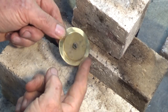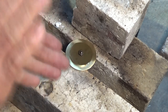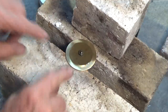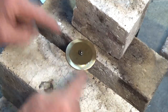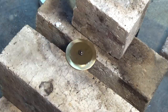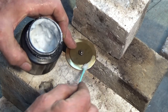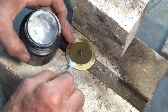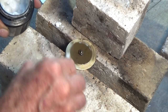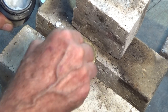This is going to be the cap on top of the steam dome, and it's made of two pieces of brass sheet — they're going to be silver-soldered together. The only reason I'm using two pieces is that I've got lots of this two millimetre thick brass sheet and don't have anything thicker, so to get the look I want we're just going to laminate them together. I'm just going to put the flux on the outside — it's all clean on the inside — and we're just going to get some of that silver solder to flow around the edge of the joint.